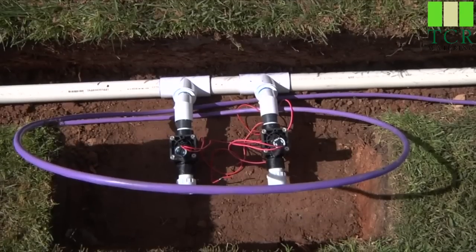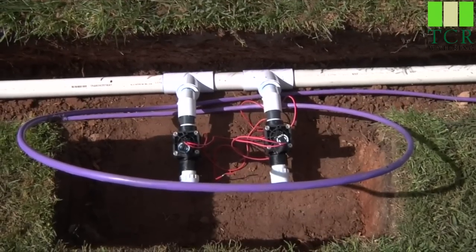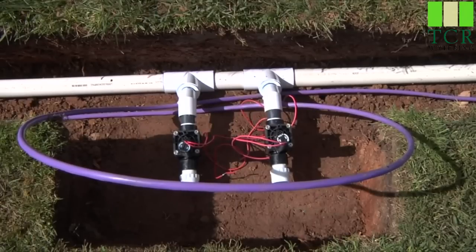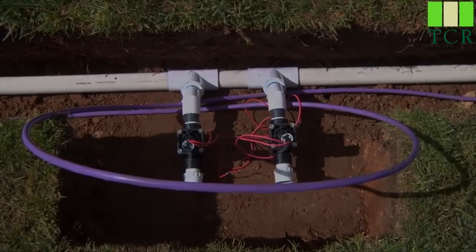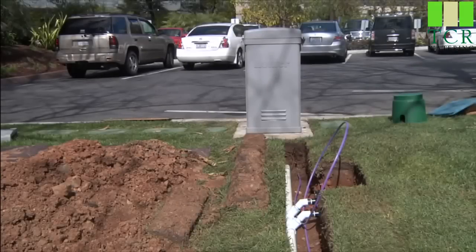Here are some valves in need of a decoder. The valves are already plumbed into the pipe and the ID wire has been run into the valve box area. We have left about 5 feet or 1.5 meters of slack to work with at each valve location. This is an important specification because it will make the installation and all future service much easier, and will also prevent accidental disconnection if the earth is subject to saturation or freezing.